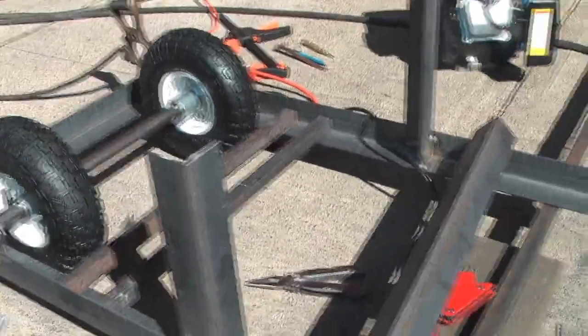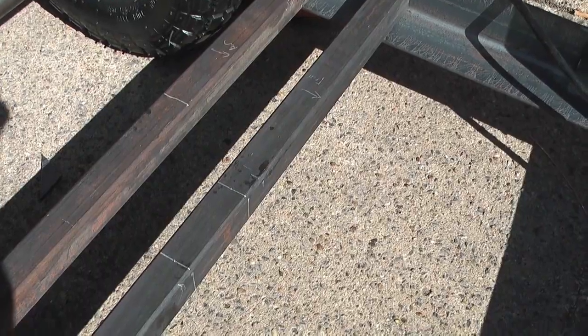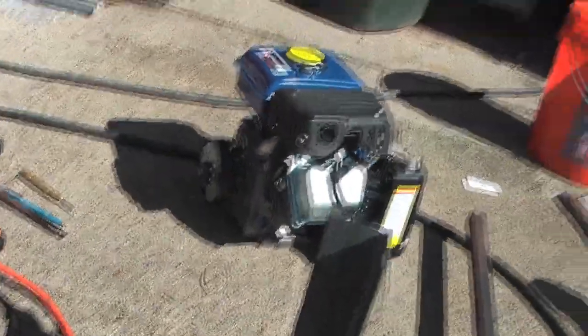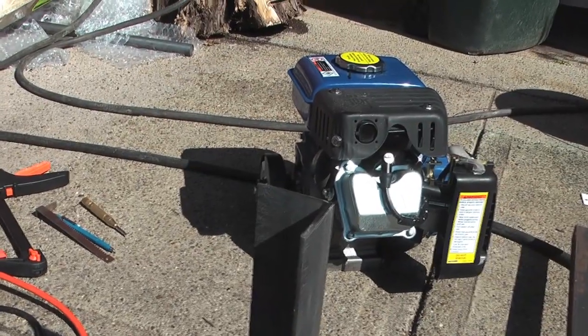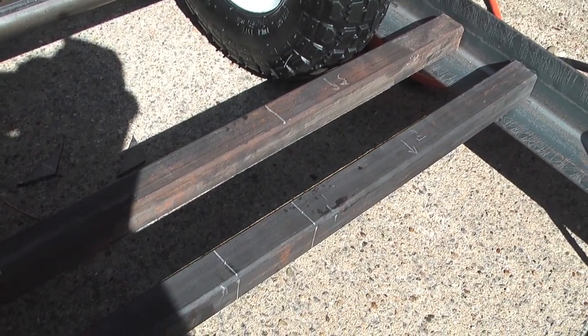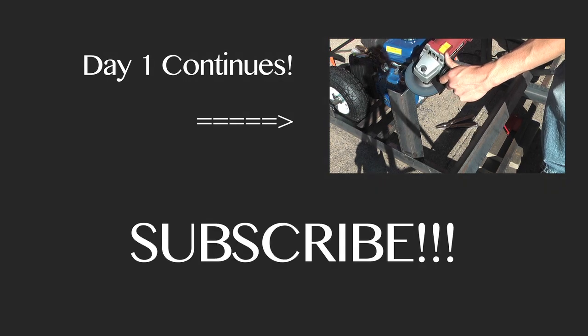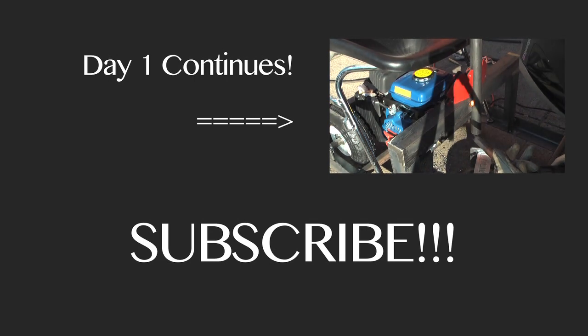Before I got too far ahead with the front frame I took a step back, removed the chair, and worked on the engine mount. I'm trying to lay out the front two holes — I got them started with the punch — but I realized I don't know what bolts I need for the engine. I don't know if it's metric or not because it's a Honda clone made in China but sold in the US. So I'm gonna run off and get the hardware I need, drill the holes, and get back to it. Hurricane's coming through, so gotta go.